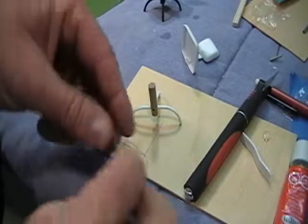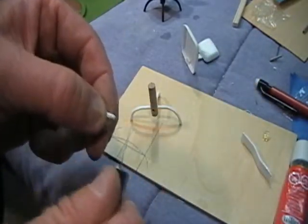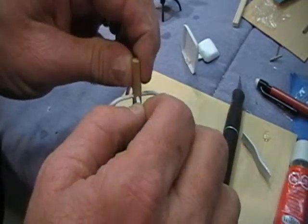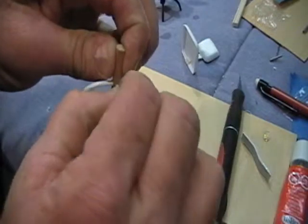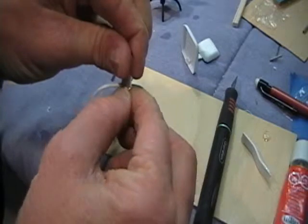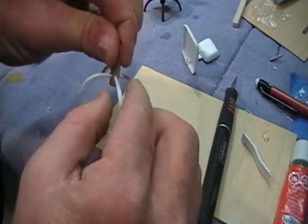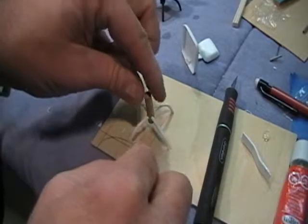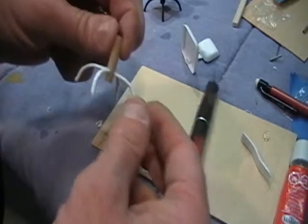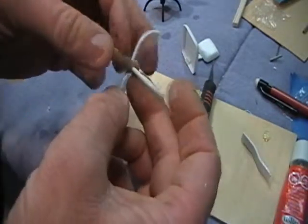I'm working with a set that hasn't fully hardened — you have to clean the edge off just barely so that it will slide into the hole. You want a nice tight fit. If you get a little bit loose, start over with another piece of dowel. Sit it down and make sure the legs are perpendicular to the table — you may have to move your legs a little bit inside the hole to get them right.